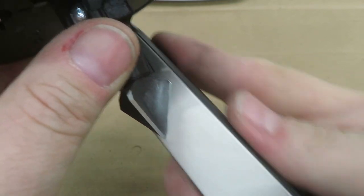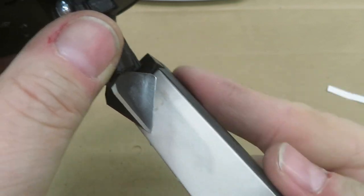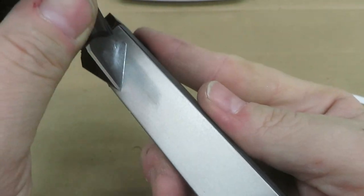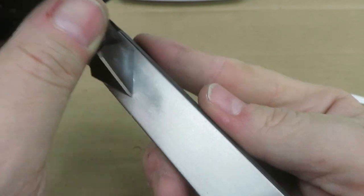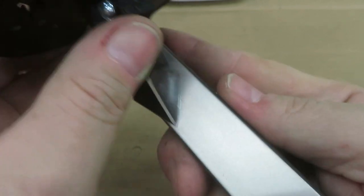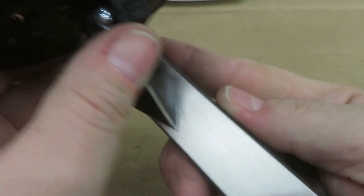Now I'm going to move the diamond instead of the broadhead. Entirely up to you what you feel more comfortable with. Now I'll move the head over the diamond and explore the whole plate. I can go way to the right here. I can go way to the left. I can swing around this plate. Don't just go down the middle and wear out the middle of the diamonds, and get as much stroke as you can.